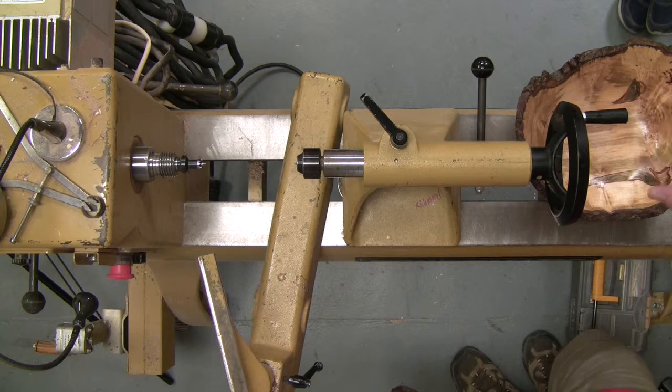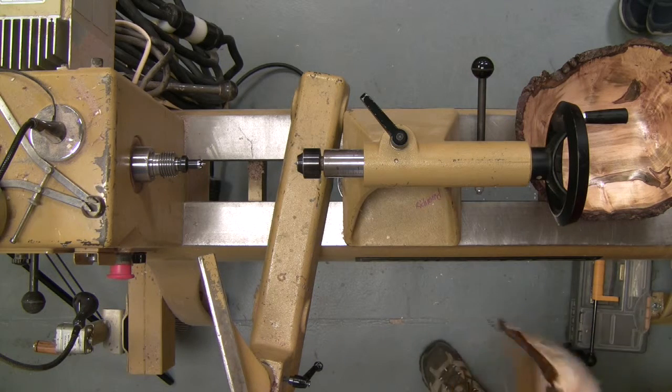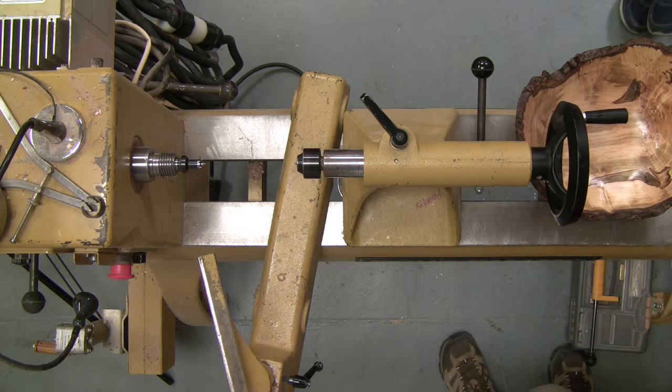On the teapot, I'll do as much. Look at the piece you have right there. So you finish the inside, finish two-thirds of the outside, then you carve it. When you say finish, sanding or sanding and finish? I usually don't apply the finish until I'm through sanding everything. Then you can't turn it, you're sanding it, you're putting a finish on by hand.